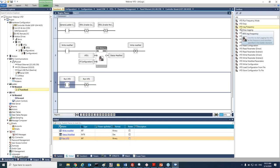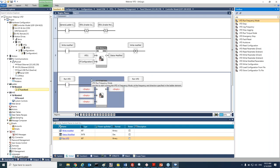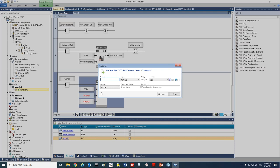And again, going to the toolbox, we have here VFD run frequency mode. Okay, again, A will indicate for which VFD you would like to run. Okay, and what is the frequency that we would like to run in? Again, it can be a constant or from a tag. At this point, let's edit it from a tag. It will be frequency